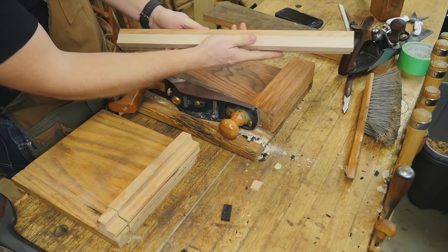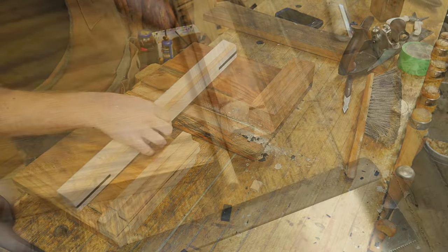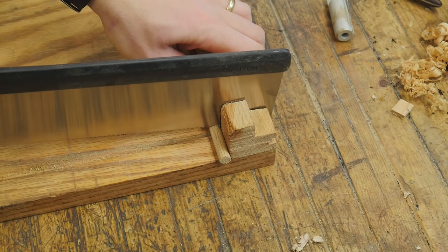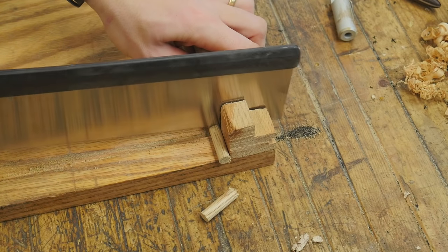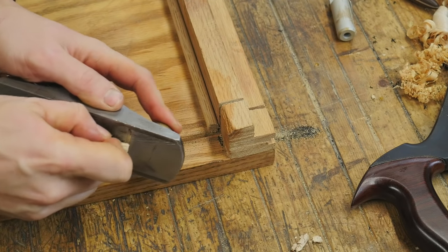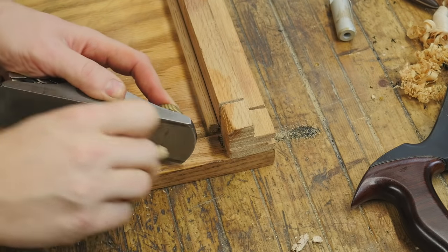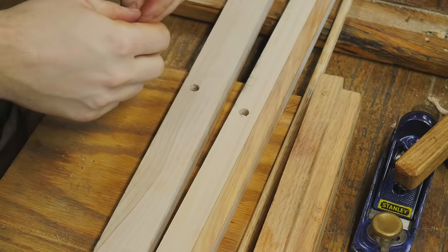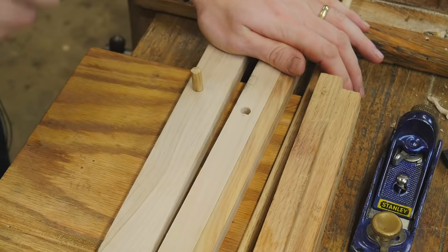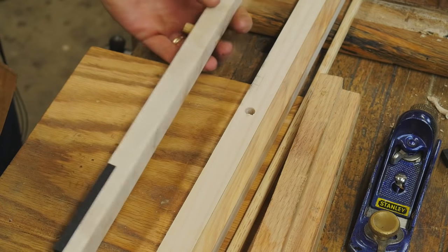So now we have our winding sticks — we have light in the front and dark in the back. The next thing I want to do is put a hole all the way through the middle so that we can put a dowel in there. For the dowels I'm going to cut them much longer than they need to be — somewhere around an inch and a quarter. I've made the holes very, very tight, so I'm going to use a block plane to trim up the ends — just rotating a little bit, putting a slight chamfer on the end making it a little easier to seat. I made the holes a couple of thousandths smaller than they needed to be, so when I pound them in I don't need any glue. I'll tap it into the other side and push it a little bit further so it's sticking out the other side a little bit.